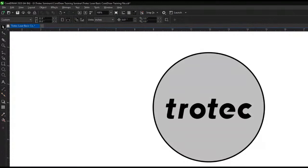The other thing is, you've got to be careful when you're laser cutting something if you have a line that is behind another object. If I have a red line that was behind this and you don't see it, the laser system will still cut that line. So you can literally cut your product in half, not realizing there's a line behind it, because you can't see it. This holds true with your vector lines or your cut line paths. So be careful to make sure that your order is set properly, and your objects aren't just behind something, that they're truly clipped and broken apart, so that they're not actually going to cut those objects out.